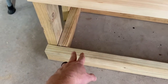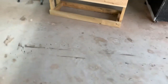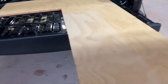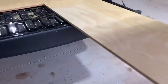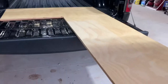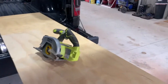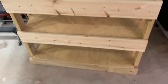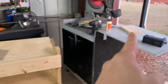The top section is about 15 inches deep; the top two tiers are 14 inches deep, and that's where I'll lay the plywood I got for free from my father-in-law. You can use one-by-eight, one-by-six, or whatever you want to rest the dumbbells on, but I'm using three-quarter-inch plywood cut with a circular saw or table saw — whatever you prefer. Once it's fitted in there it looks great, but it's still hard to fit your hands through, so I had to take it all apart again.